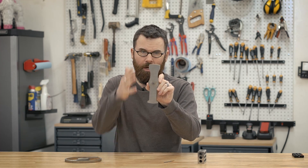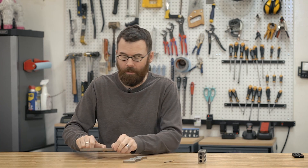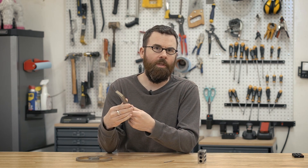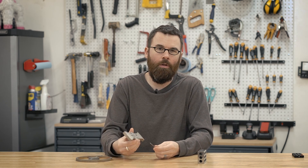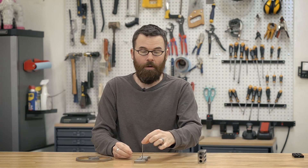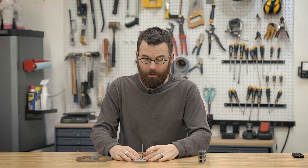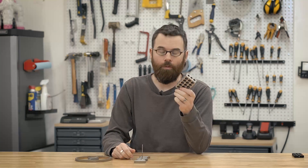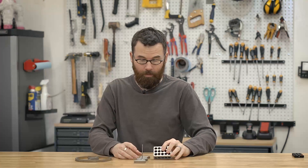We're actually cutting two different types of weapons for Rumham: a bar and the disc you saw previously. As discussed in the CAM, we're using this center hole that was cut with the water jet. We cleared it out with a drill press just to make sure there's actually an eighth-inch hole all the way through. We can then use an eighth-inch drill bit through the spindle on the chuck to get our X and Y zero coordinate. Just having this in the spindle and the part on the table gets us the X and Y zero. Then we clamp it down, and use a 1-2-3 block in one of the channels on the bed to line up with the outside and make sure it's parallel front to back.